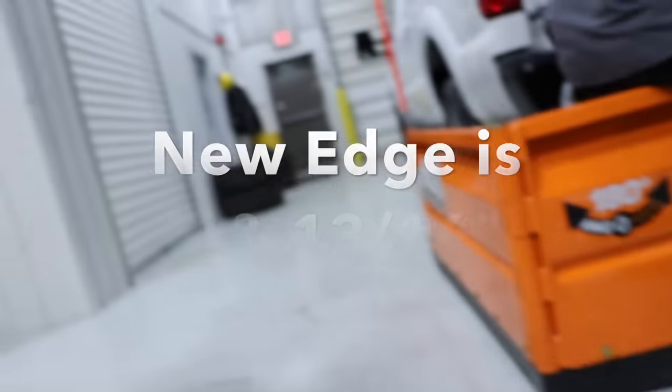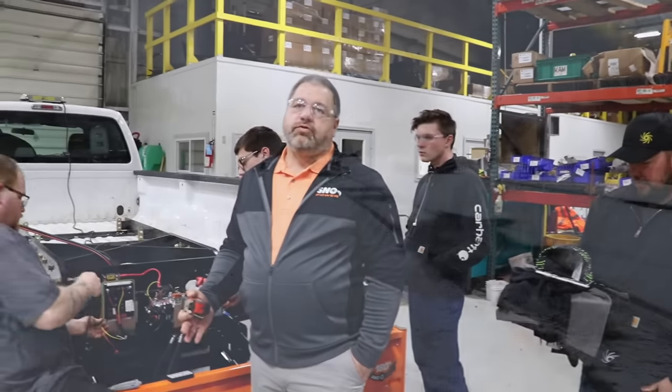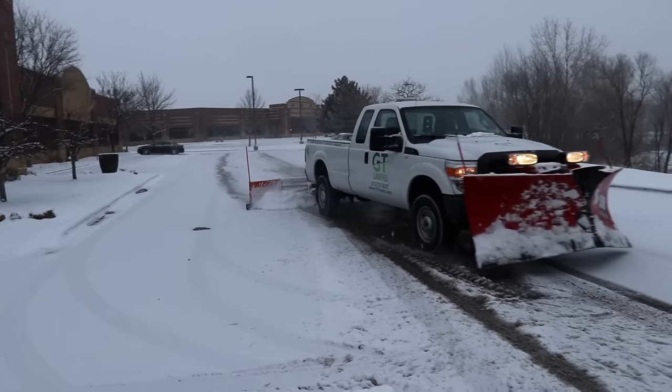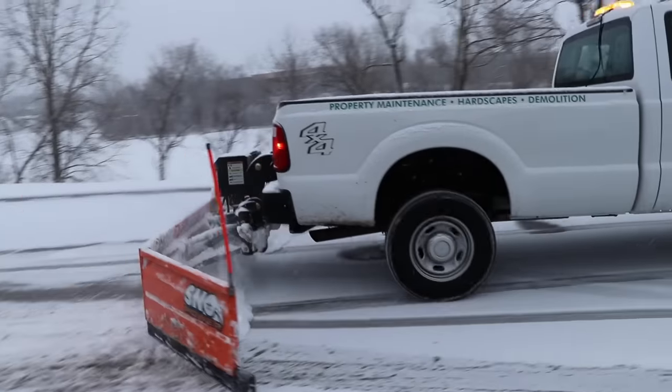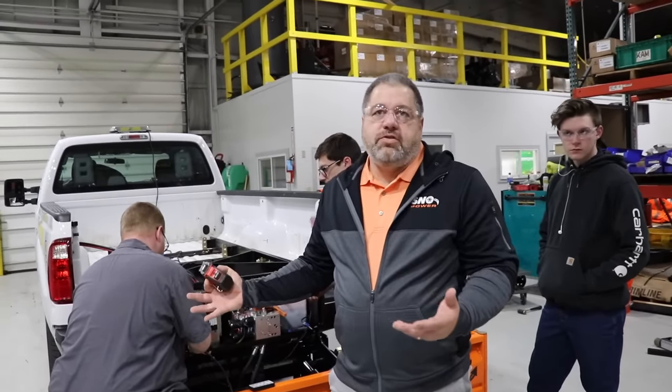You've seriously only worn a quarter of an inch off your blade in a single season, plowing 50 times — and that's not mom-and-pop plowing, that's doing full commercial lots. Long runs too, so it's heating up that poly. The more snow you have, there's more lubricity — that's the biggest thing. If it's dry you're going to wear it out fast, but when you have snow on the ground it's smooth and you're barely even touching the cutting edge.